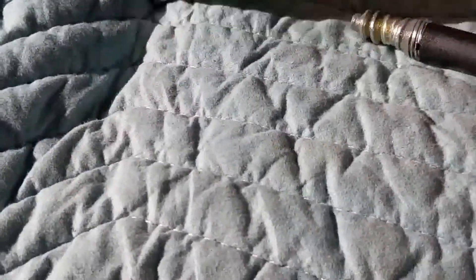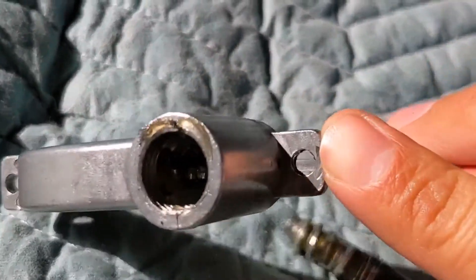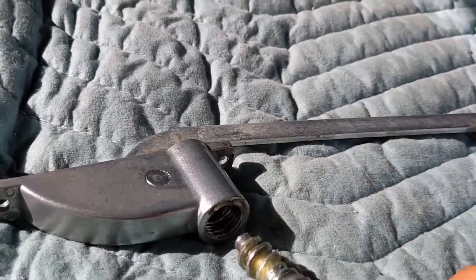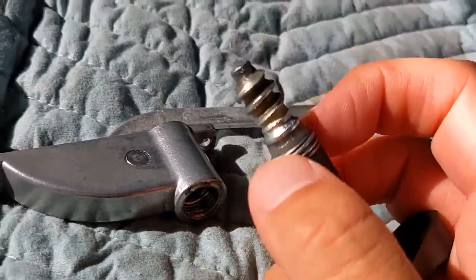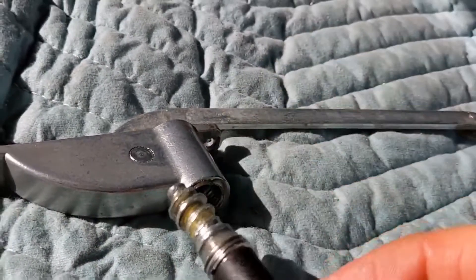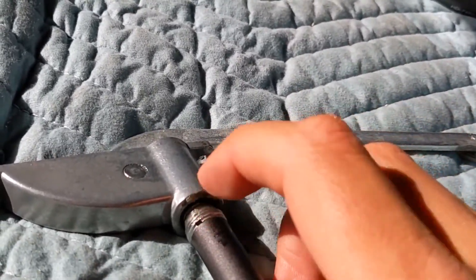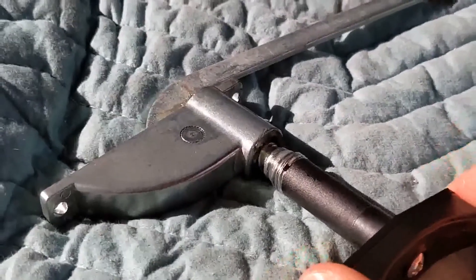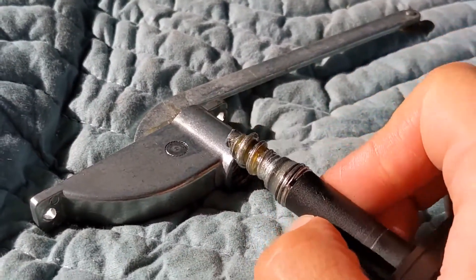Let me show how this works. Inside, as you turn this piece, this mounting here is meant to stay fixed while this little cam rotates independently. This cam piece is meant to sit in here, stay stuck, and then lift and lower the arm. My problem is that from using it very regularly, this piece has backed out and now it doesn't get the force it needs.